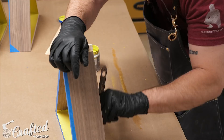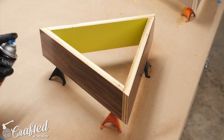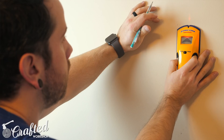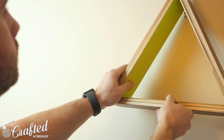After letting the paint dry, I came back with some spray polyurethane and sealed all of the edges and sides of the shelves, and that really brought out the grain of the walnut veneer plywood. Once all the finishes were dry, it was time to mount the shelves — just use a couple of finished nails. If you're hanging the triangle upright, use one finished nail in the upper corner, and make sure to drive it into the stud since it's only hanging by one single nail. For the shelves hung upside down, I used two finished nails, one in each corner, and just drove those into drywall since they were between the studs.